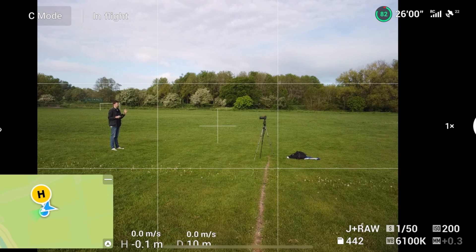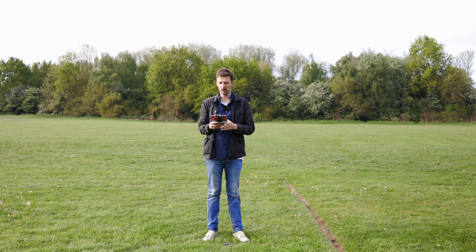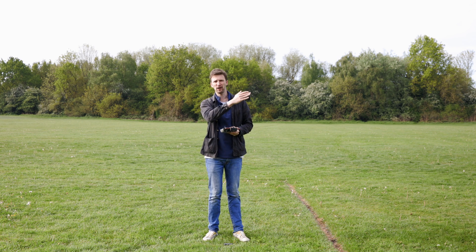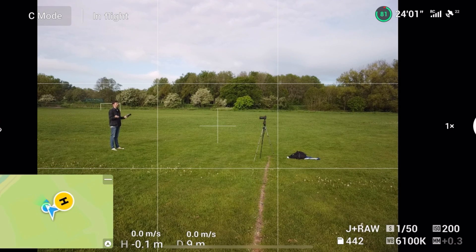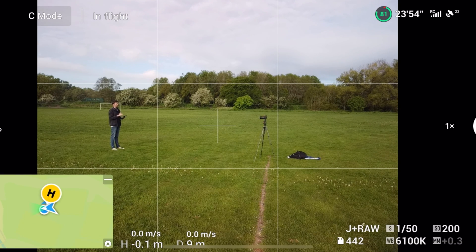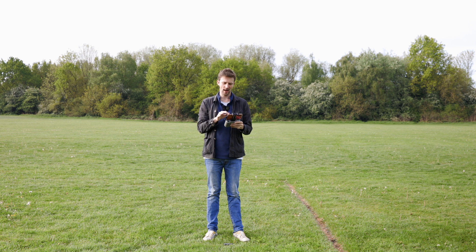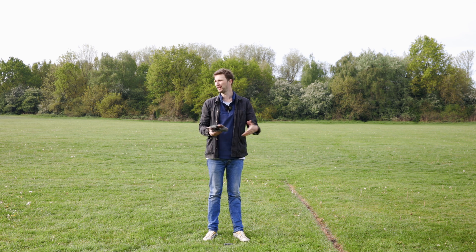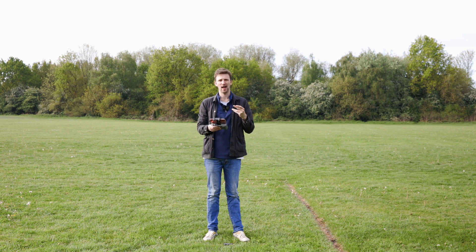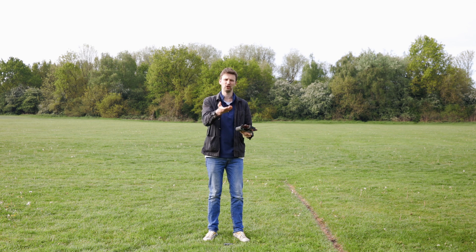Finally, keep an eye on the battery. Up here we've got 83% — so we've used 17% already. Drone batteries can go down quite quickly. Anything green means you're fine. The orange dial shows how much battery is needed to return to home — the further you fly, the larger that orange portion gets because it takes longer and more power to get back. Red means the drone will say 'I'm going to land here, I don't have enough power to return.' You want to start heading back while it's still orange, ideally green.